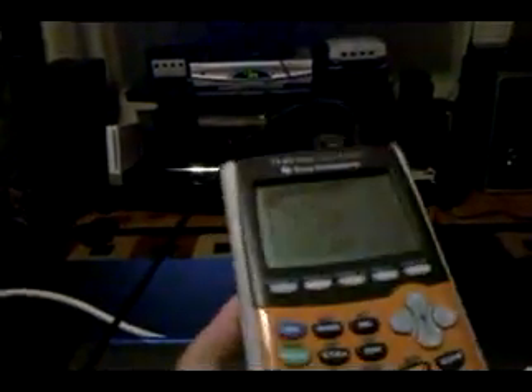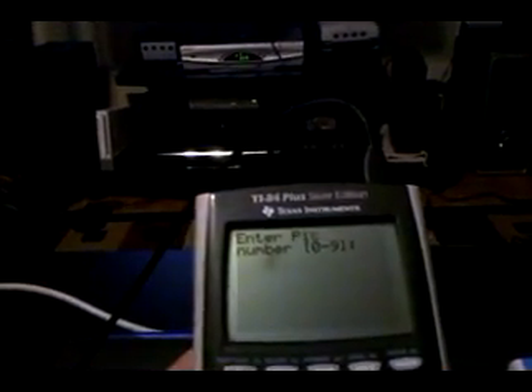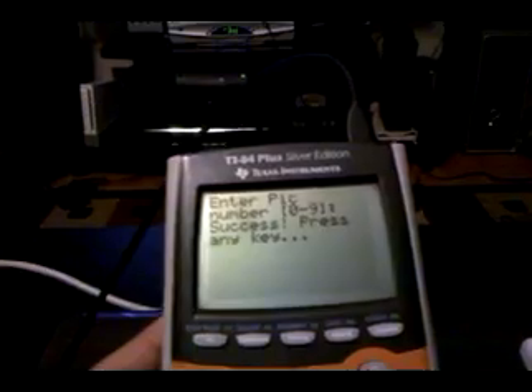So the OS also doesn't have to do anything to actually output its contents once it's initially set it up. I have managed to figure out how to disable that extra hardware through code and reverse the protocol that the adapter uses, so that we can output whatever we want to the TV and not just what's currently on the screen. That has massive potential for games, dual-screen applications, or just screwing with your teacher, you know, whatever. I have a little proof-of-concept application here which will display whatever picture you want on the TV. And you can see that the calculator's LCD and the TV have different images.